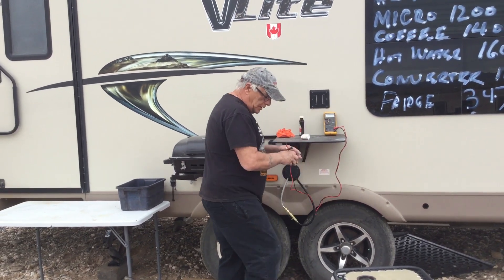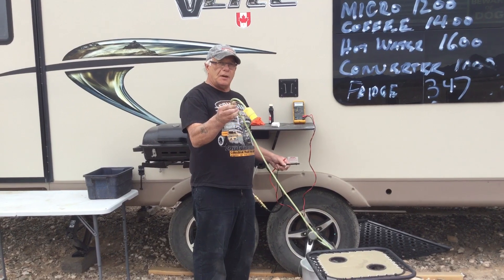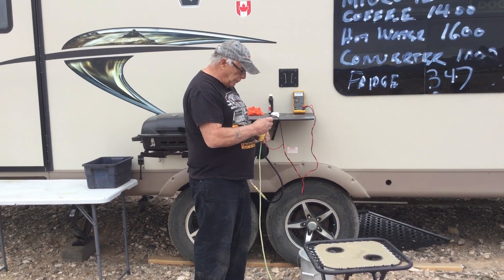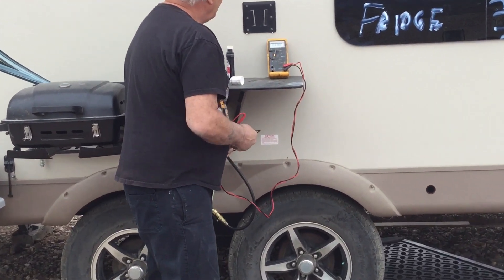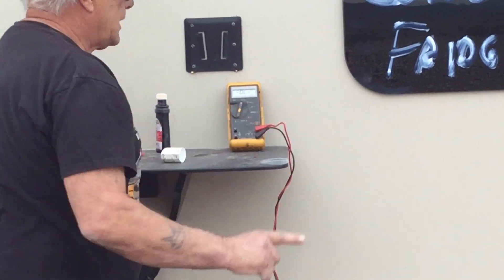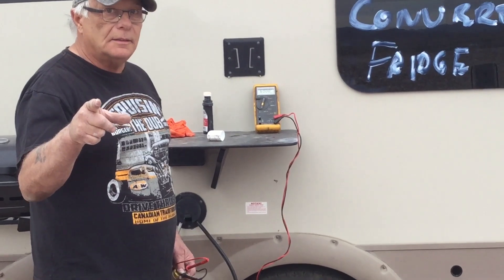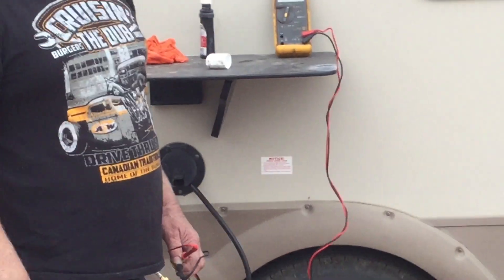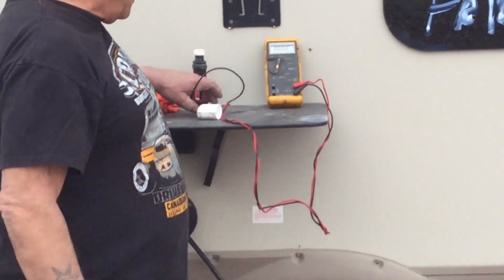This here is my good old multimeter. Ninety percent of the time I plug in with this cord — this is a 12-3 wire, and it's plugged into the generator on the other side, so it's 100 feet. There you go: 125 volts. Now I'm going to change it. Everybody knows the magic number for electric is 60 hertz. Now we're plugged into a 100 foot cord — look at that: 60 hertz, right on 60 hertz. So the cord isn't really the big deal. I've plugged into that green cord since I've had it and never had a problem. Everybody says you can't do it — I'm here to tell you you can, because I do it all the time.